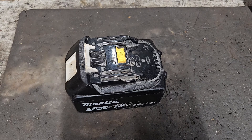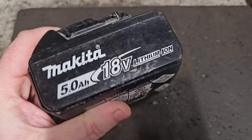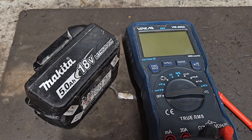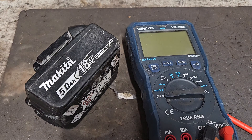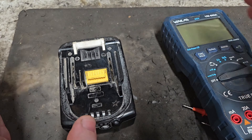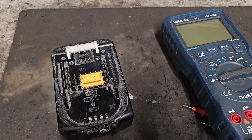Hello and welcome. In this video I'm going to show you how to do the easiest, most basic test on your lithium-ion battery — in this case focused around the Makita LXT 5 amp-hour. What you need for this test is a multimeter; the one I have here is quite a decent one, but you can use even the most basic model. The first test doesn't involve opening the battery — it's just an overall voltage test of what it's putting out to your tool. A healthy voltage for an 18-volt or 20-volt battery would be between 17 volts and just over 20 volts, with the variance depending on the level of charge in the battery at the time.